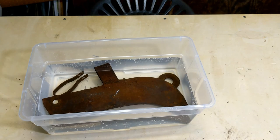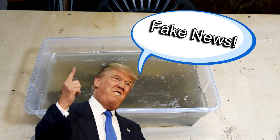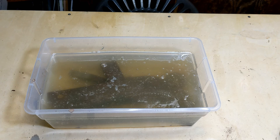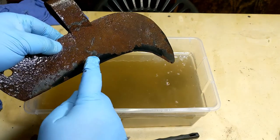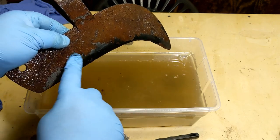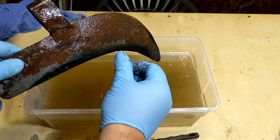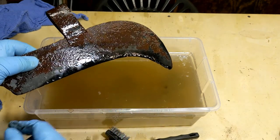Just watch — the next 24 hours I will be back. And we're back. The container is slightly more full than when we left. I added more vinegar. So if you look at that, there are areas here where the rust has just come off in chunks. Let's take a brush and go over this — it's just wiping off — but let's knock off the stuff that's still stuck on here.